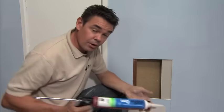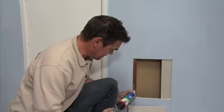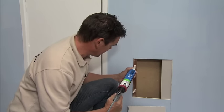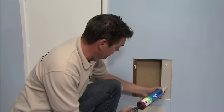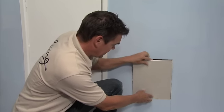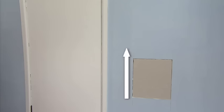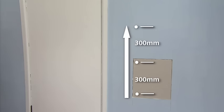To fix it in place, I'm going to use some Jib Fix 1 adhesive. All I've got to do is apply a couple of dobs here to the stud and over here to the back block. Fit it into place and wait for it to dry. I can come back later and plaster over the joins. For holes larger than 300mm, Jib Fix 1 adhesive needs to be placed at a maximum of 300mm centres.